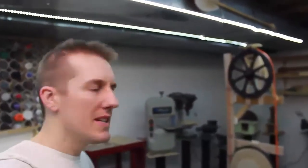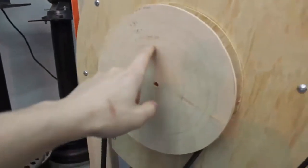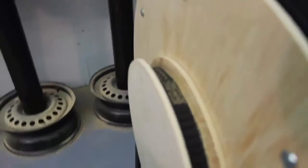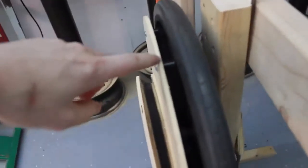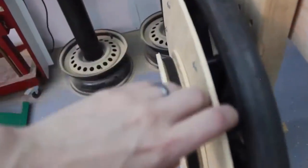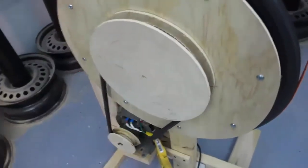Here's the 9-inch pulley — 9-inch diameter, with a V-belt riding in it. I have a 3-inch pulley on the motor. This is not the final motor. I think I'm going to attach it using a metal bar that was already part of the wheelchair — the holes and brackets are already there, so I might use that original plate or come up with something new.